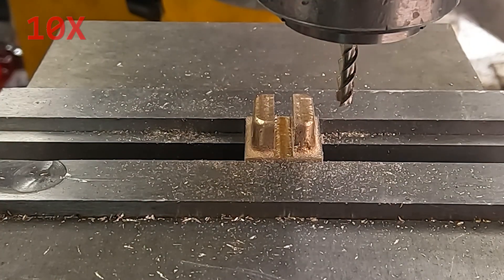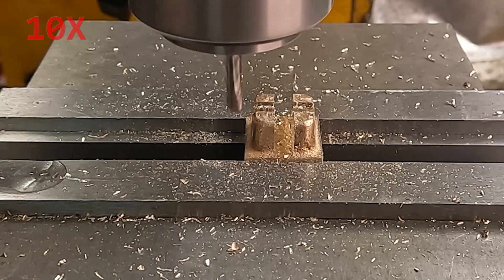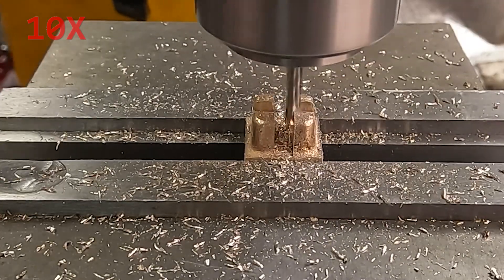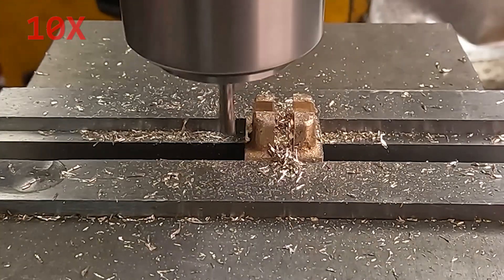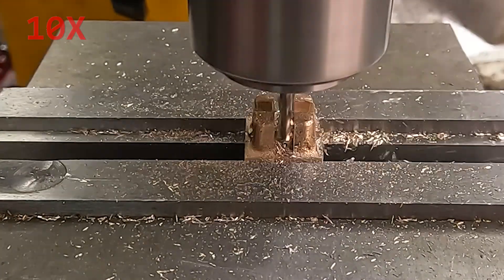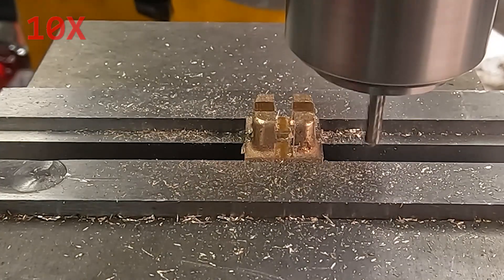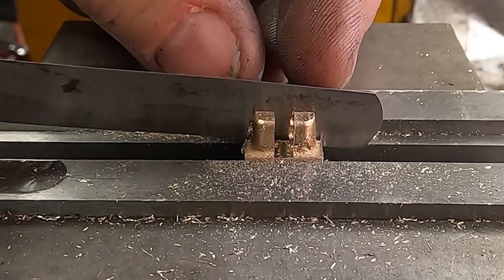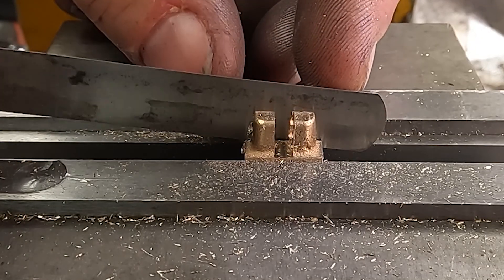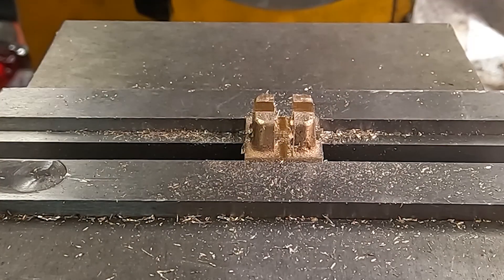For the cross slot it is wider, so I'm going in with the 1/8th and then I'm going to measure the width that I get. It comes out about 4 thou oversize and then I move it out to either side to get to the final width. That last part was done off-camera and that's where the only error happened — I managed to break an end mill by zeroing the mill without zeroing Z before X and Y, and I crashed the mill into the part.